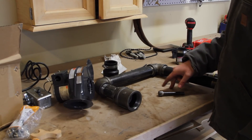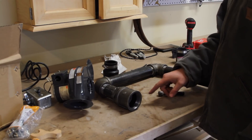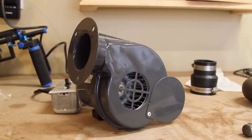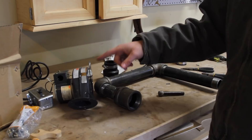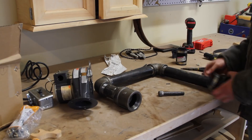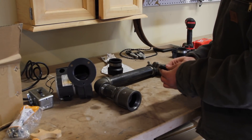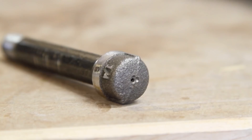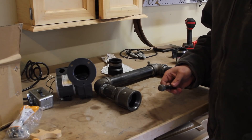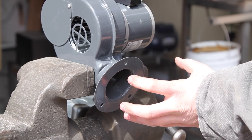This is the main burner assembly. It's inch and a half pipe. These two pieces are 12 inches long, that piece is four inches long. I have two elbows, and this is an adapter that goes from inch and a half to two inch pipe. This is a Dayton blower I ordered from Amazon. I have an electrical switch right there to turn it on and off, and this is a rubber fitting I'm going to use to attach the blower to the burner. I'm going to cut this off so I can fit it around the burner, and this is where the propane is going to be entering the burner. I drilled a 16th of an inch orifice in this cap right here, and that's what the propane is going to come out of.